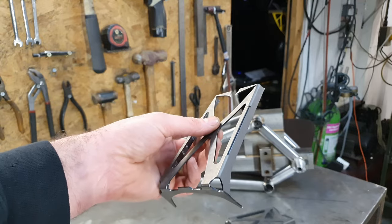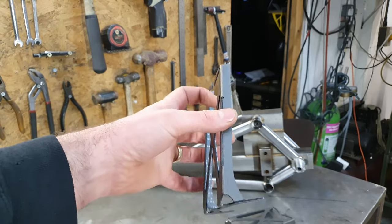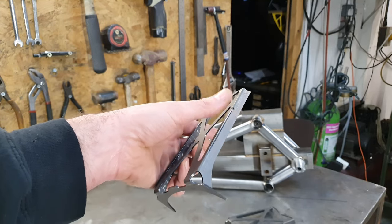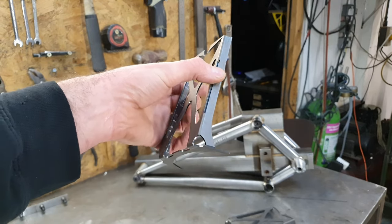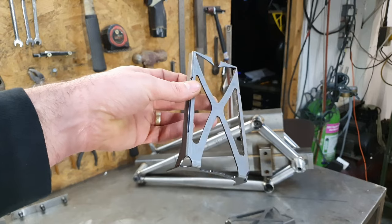So this brown stuff on the top of the steel is mill scale, it's not steel. It forms on top of the steel during the manufacturing process. I've got to get that off of there before I start welding. Not only is it going to make a weaker weld, but it also messes with the actual welding process and makes it really difficult to get a good looking weld.